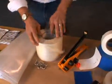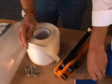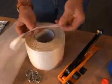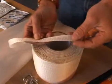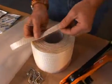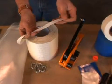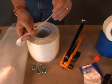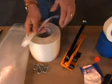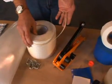Now, another almost a system all by itself is the strapping, buckling, and tensioning tool. These 3 items are what is used to install this woven polyester cord strapping on the boat. This forms the support structure, and it also goes around machinery and boats as a perimeter band holding the shrink wrap on. So this is very strong. It's 1,200 pounds tensile strength, and it has no stretch. By using this in the buckles, you'll see how we do that. And with the tensioning tool, you can make a very tight strapping system that's easily installed and very strong.